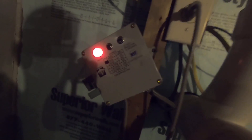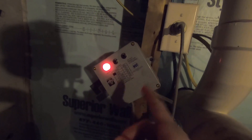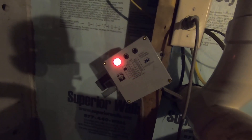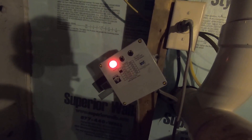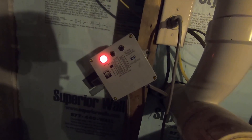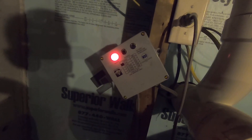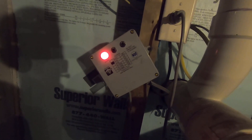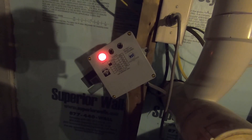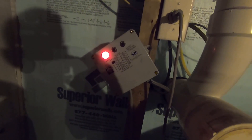That light and alarm means we have a problem. There are two different things that can trip an alarm on this type of septic system. Number one, there is a sensor that detects airflow - if your airflow stops working it will trip the alarm. Also, if the water level gets too high in the sewage treatment plant it will trip a sensor and set off the alarm. Either way it requires attention. You can silence the alarm by pressing this button until you figure out what the problem is.